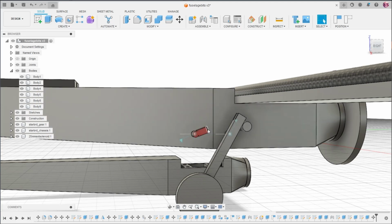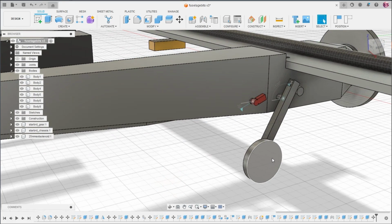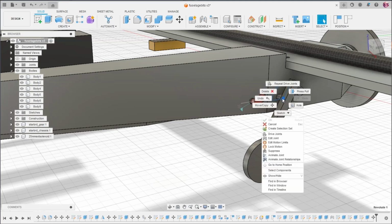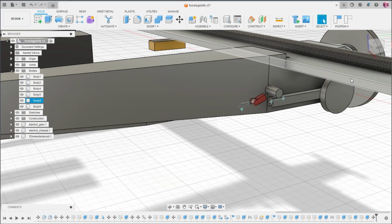So imagine there's a thing going from here to the top of the actual landing gear. This is the wheel, if that's not apparent. And so when you land, the force is going to push this upwards, obviously. It's going to pivot around here and just knock against this pin, which doesn't care, and not wreck your solenoid or servo. And I even have this fancy little hinge mechanism so that you can see how it moves.